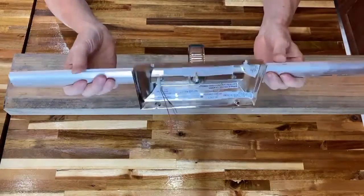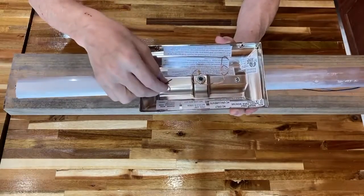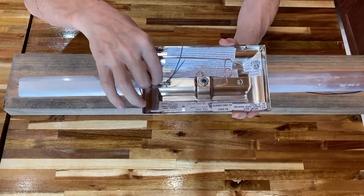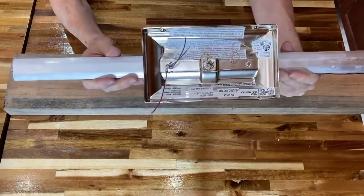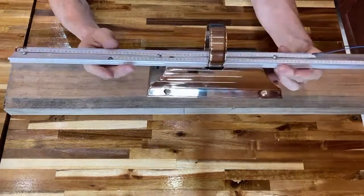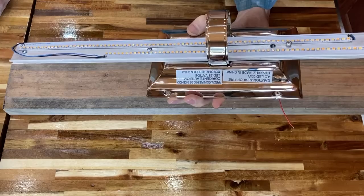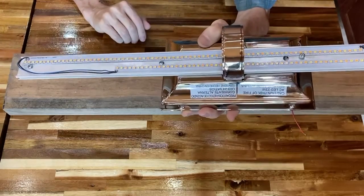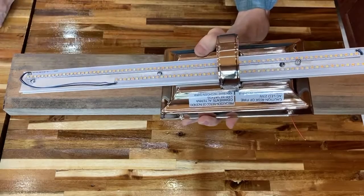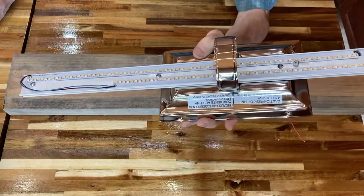On the back side, we've run the low voltage wires through a little bit of insulation, and we will then attach these to the ATX LED dimmer, which manages the color temperature. And now we can remove the 120-volt labels and the warning about heat and power, because we now have a low heat, tunable white, dimmable fixture.